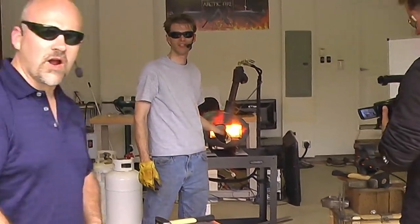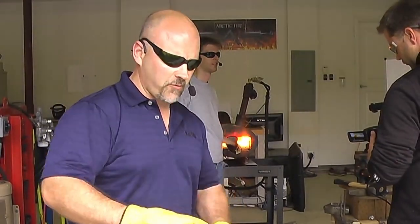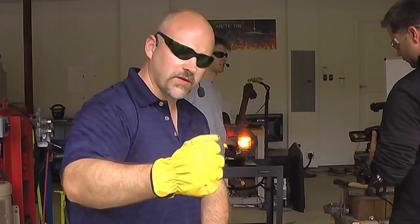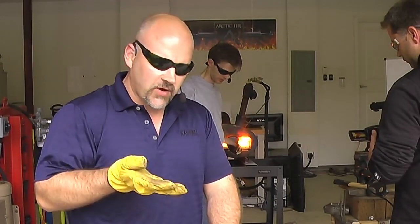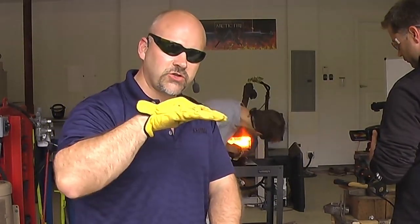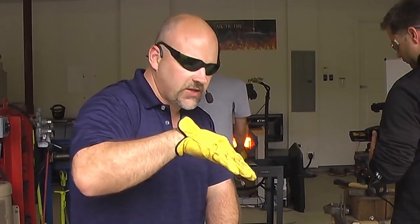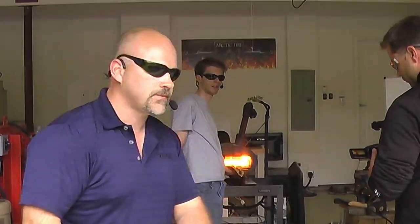Yeah, if you guys want to try this at home, forging, you can practice with Play-Doh. Literally, you get a bar of Play-Doh, and use your fist as a hammer, and watch how it'll curve, it'll sort of banana itself. So when you actually create the curve of a knife upward, at first you forge the profile straight or even down. So when you strike the bevels on the edge, it curves up and counters either the straightness or the counter curve you put in.